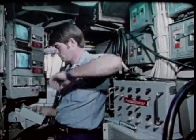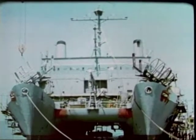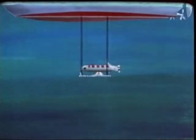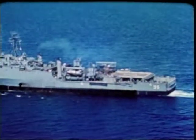When the last rescuee is aboard the mother submarine, the mission begins the return phase, and all the support equipment is returned to rescue unit home port. This return is normally the reverse of the response phase. The DSRV can also work from an ASR-21 submarine rescue ship, which is equipped with decompression chambers and other deep diving systems. The catamaran ASR launches and recovers the DSRV through the center well. The DSRV may be supported by a ship of opportunity if a mother sub or ASR are not available.